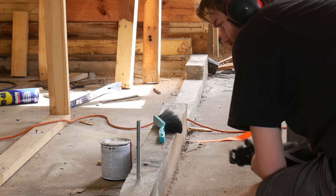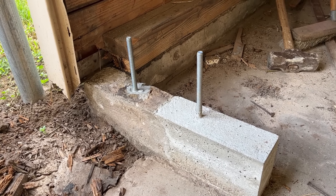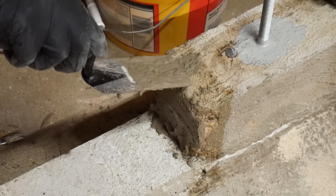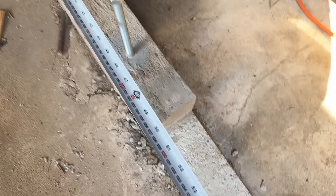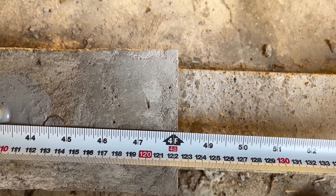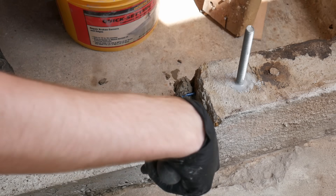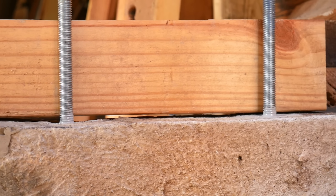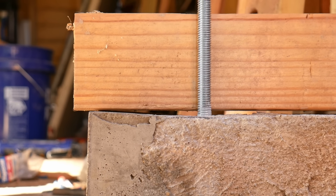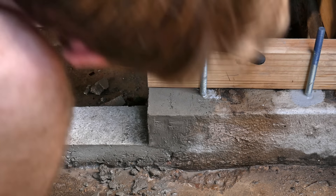For posterity's sake, I not only replaced the original concrete anchors with new ones, but also added enough for there to be two for each section of the stem wall. I then finished up the last bit of foundation work — squaring up and filling out the edges of the doorway with fast-setting concrete. This was to make the middle stem wall section the exact same width as the sheathing that I'll be using. The other edge of the opening was already pretty square, but I still had to add in a bit more concrete there too. It wasn't exactly a difficult task, though it probably would have been a lot easier if I hadn't accidentally tilted the form at an angle, making it so the sill plate can't sit flush with the surface.